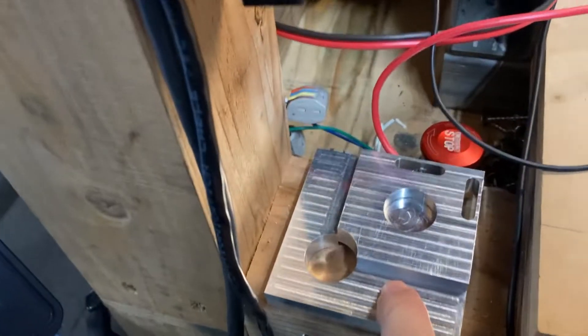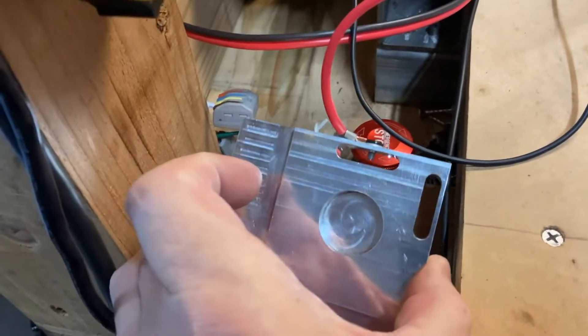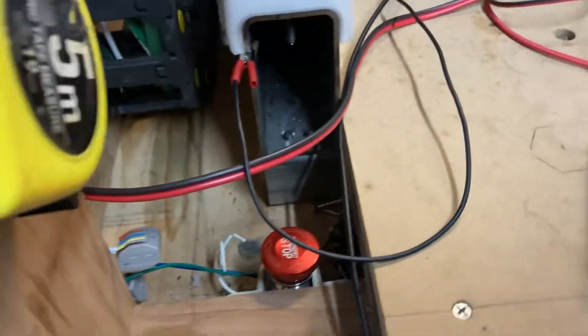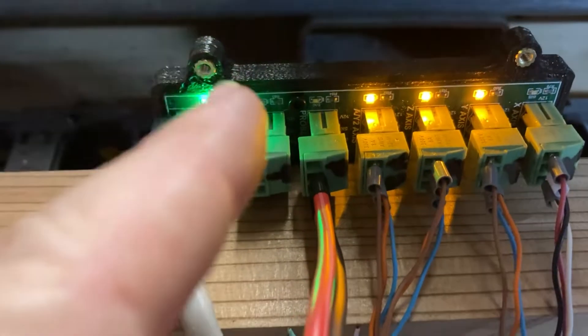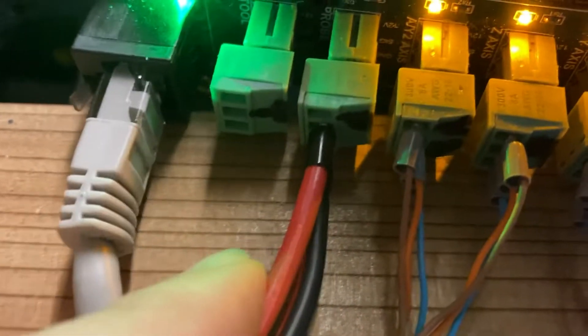Part two of the video on the touch plate probe. I've got it wired up. It goes from the probe here through this screw, and I've got it going to the breakout board for the HAL 2K EST board. It goes into this one here, which is the probe connector, and I've got it into the middle and outside connector.